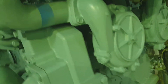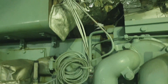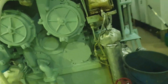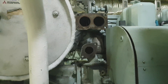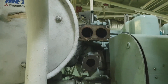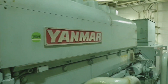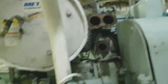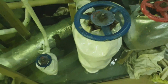As always, before carrying out any job we have to secure the engine properly. In this job, we need to close the starting air system, block the air start system, the fuel, the lube oil, and of course the cooling water. We need to close the inlet of all the cooling water of the engine, secure everything, then carry out the lockout and tagout procedure.